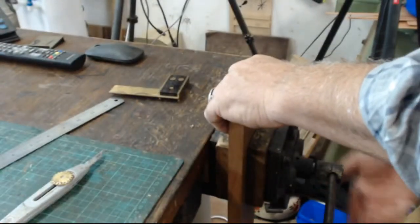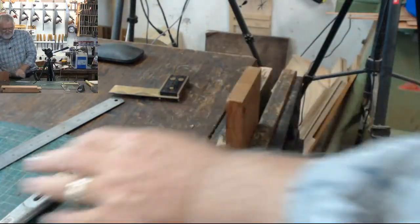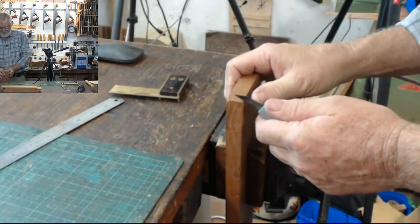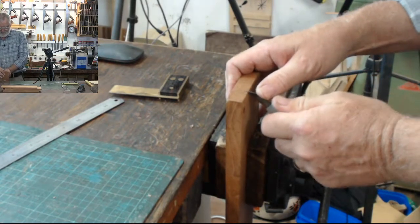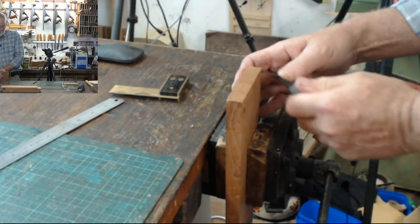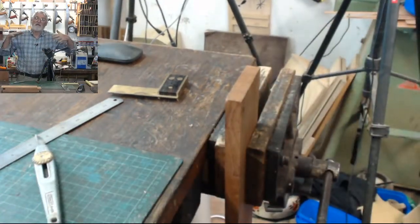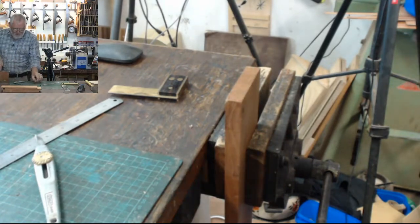There is a way you can do dovetails and you don't even need to set it, you just do it with a saw. And if I'm doing a lot and it's not for a really special piece, I'll just freehand them. The tails themselves aren't as crucial as the sockets or the pins, because we'll cut the pins and the sockets, or sockets. I prefer calling them pins. I think UK call them sockets. They have to then fit the tail. So no matter what disaster happens with the tails, providing you cut the pins to match, it's going to be good.